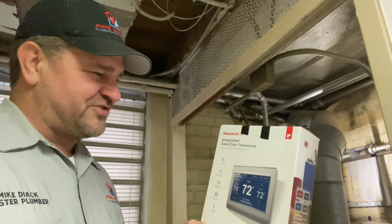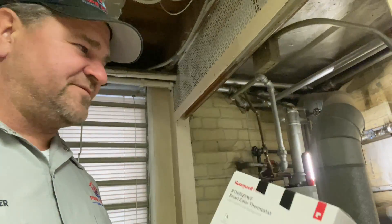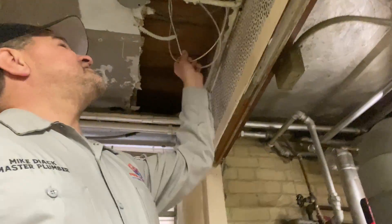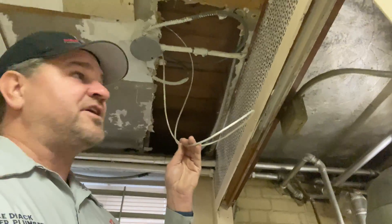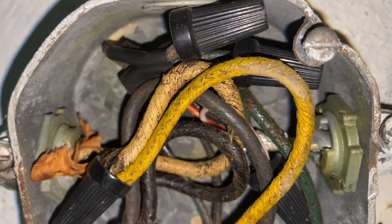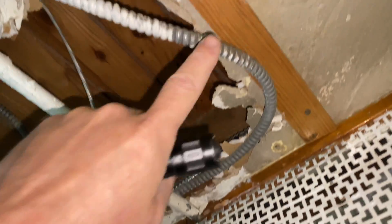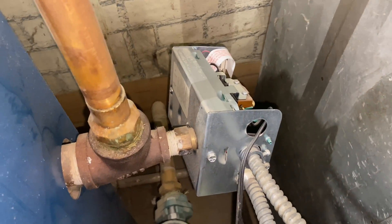My mission which I chose to accept is to install this Honeywell 9000 Smart Color — I love these, absolutely love this. We are going to install it now. The homeowner couldn't find the thermostat wire going to the boiler room because it wasn't in the boiler room — it was in the ceiling above it. Here's that wire, and you can see we're using this junction box for line and low voltage wiring. We're going to take this wire out of here and run it through this BX armored cable — or MC cable — to the aquastat relay, which I just loosened the set screw on.